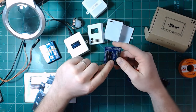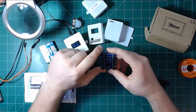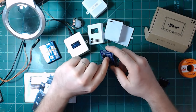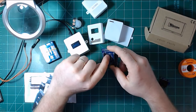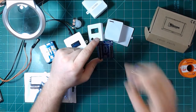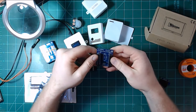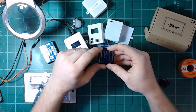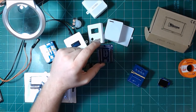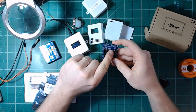I wanted to fix that issue to make it more reliable for people using these boards with other LED strips. I'm now using a very fast 74HCT125 four-channel level shifter, so that should fix the problem. Even LED strips that require a 5-volt data line should work. That was one issue I wanted to fix.